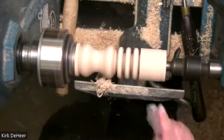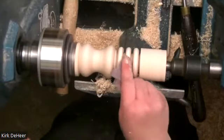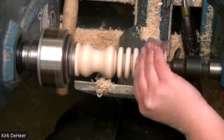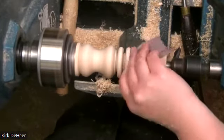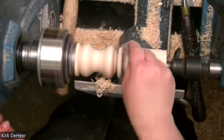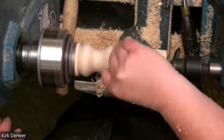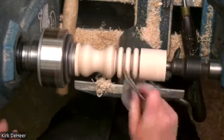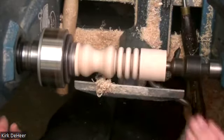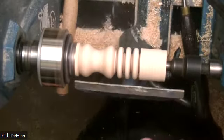If you've got any ridges, this is your chance to get rid of them. Just stick a little piece of 180 down in there — look pretty good. You can also polish your rings right now if you'd like — I've done these out of epoxy even. This is your saving grace as long as you don't cut through, because sanding captive rings after they've been parted off is a pain in the neck. If my lathe is not running, I am not having fun — I'm going to put that on a t-shirt. Now is the chance we have to part these off.